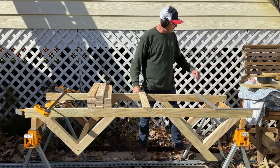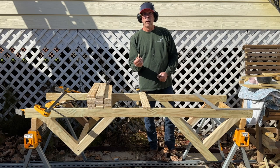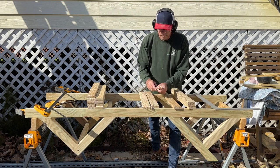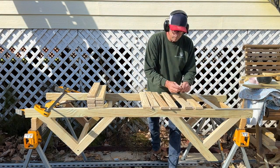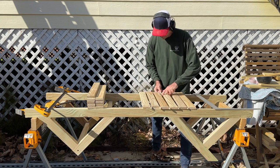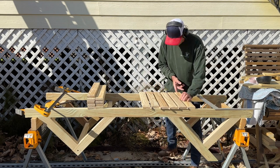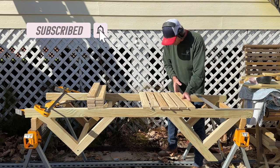And here's another thing. I designed this to have half inch spacing. And I found out that my half inch dowels are very convenient spacers. Yeah, I could put some of these over here. And with the spacers, you can do several at a time without going crazy. Give me one more. Thank you. So, put a little pressure on it that way. Instead of having to measure each one, and instead of wondering if it's square, we know the spacers are all consistent.